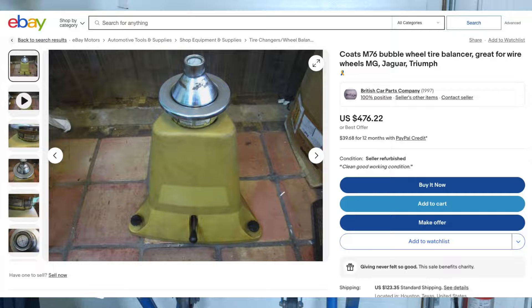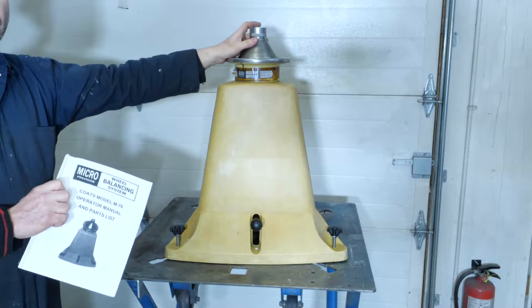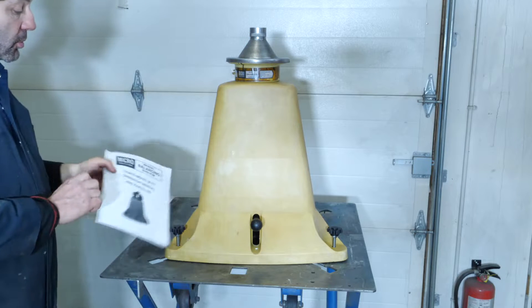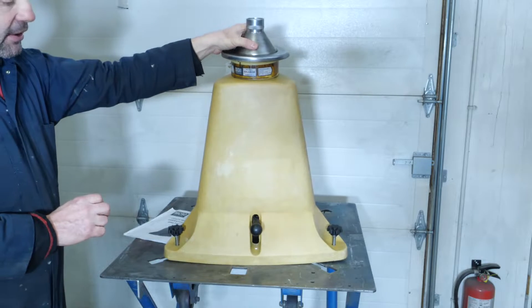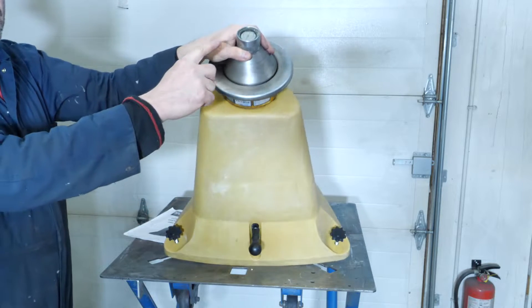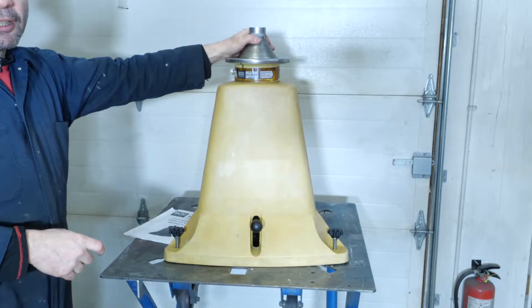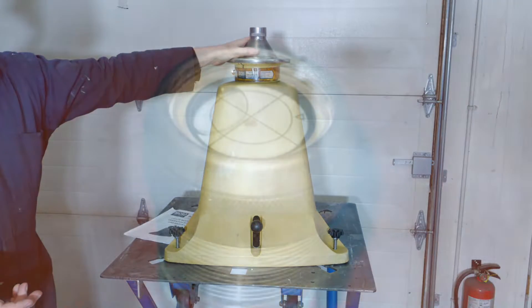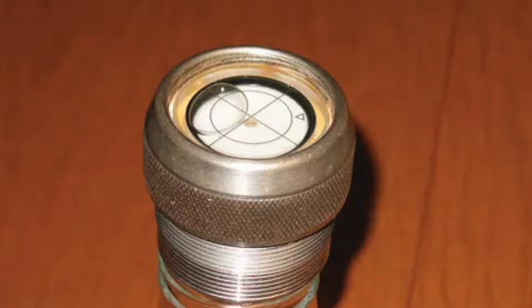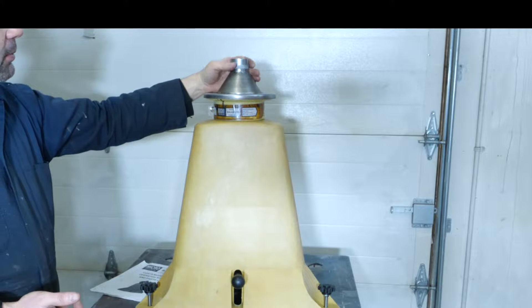This video is about the cap and the cap internals, specifically with respect to the scale. The most common issue and question about this cap is whether it can be refilled with the fluid inside to make the bubble smaller. As the cap loses fluid — either it leaks out or evaporates — the bubble becomes too large to indicate scale deflection and the balancer becomes unusable.